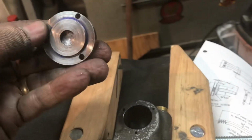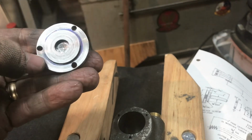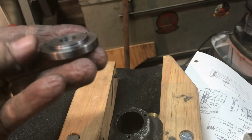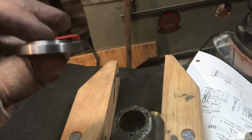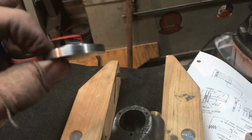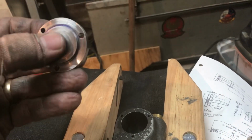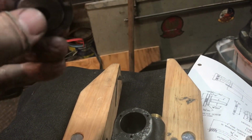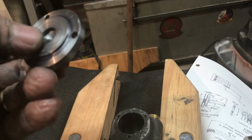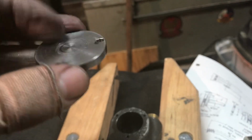I did, the trick I showed you in the middle segment about drilling the holes. It's okay. The holes didn't come perfectly on center. You can see I've actually opened them up and elongated them a little bit just so they would fit the screws. But there's the little shoulder. That's 1/16 of an inch. The blank thickness overall is 1/4 inch. So it's 3/8 shoulder, 1/8 inch, or I'm sorry. It's a 3/16 thickness here, a 1/16 here. The pocket for the spring is 1/8 inch deep, and then it has the 3 holes.